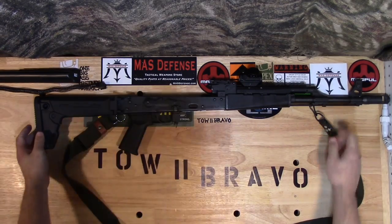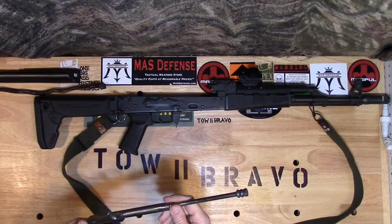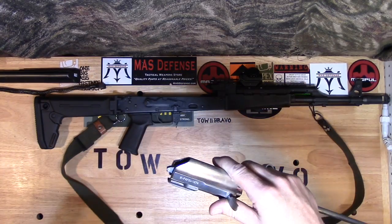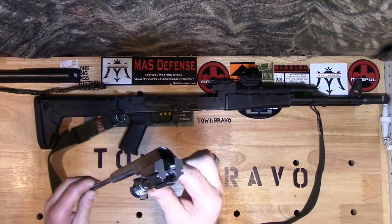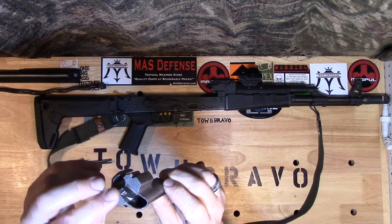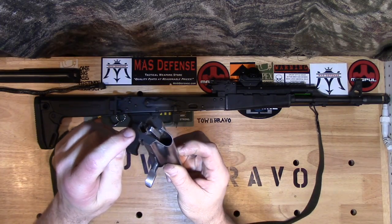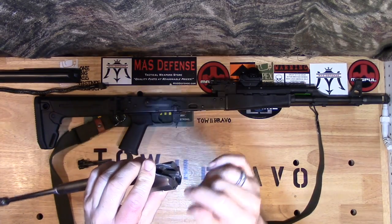Alright, so I have the weapon taken apart. There are some areas that I've been keeping an eye on that have been covered in previous videos. One of those areas is the rear of the bolt carrier, where I experienced my mushrooming. This has been well documented and spoken about by numerous parties. I don't think I've had any more mushrooming — I had it marked from almost ten months ago and it hasn't progressed any further. I've filed the mushroomed edges down, so there is no more progression in the mushrooming of the metal. It's pretty much stabilized at this point.